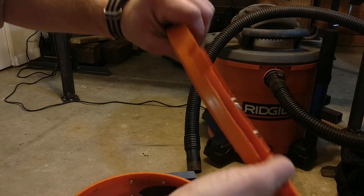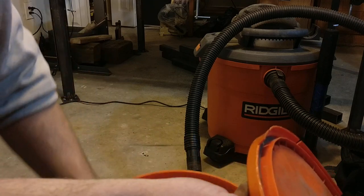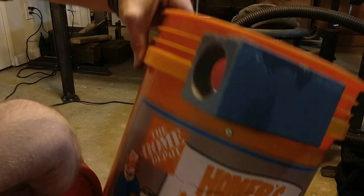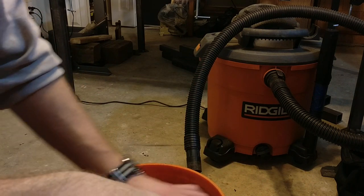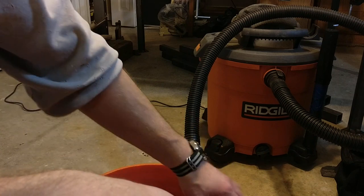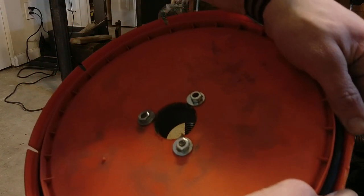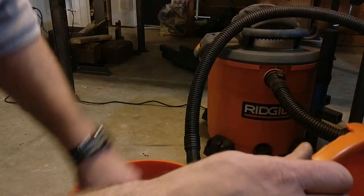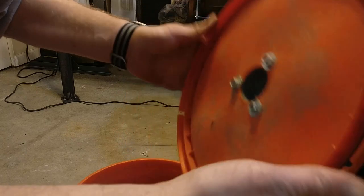You might also need to cut a clearance on this lid to make room for the inlet. The inlet position should be just a little bit beneath the lip of the bucket — maybe 3/8 or half an inch beneath the lip. It's been designed with a taper to fit the radius at the top and the bottom. But with this lip still intact and this clearance cut, if you don't cut the tab all the way and leave about half of it, you can maintain the hook on that tab. So that hook can still engage on the lip of the bucket and give you a nice seal all the way around with the gasket on the lid.